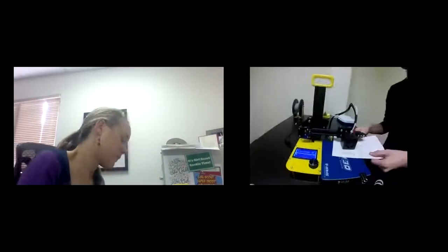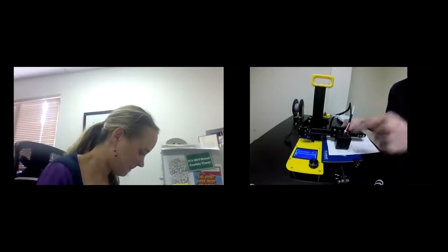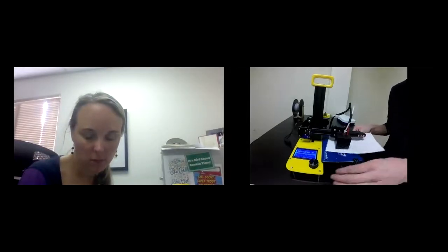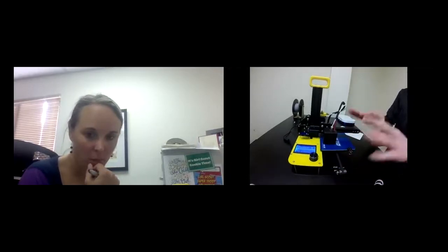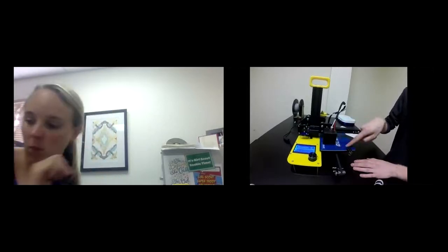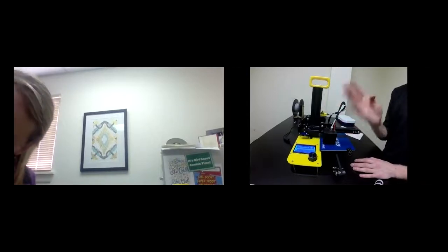Once you have every point checked, I like to check the middle too — once every point feels okay, check the middle to make sure it feels right. So now we're going to talk a little bit about filament and how to load it in and prepare it for printing. We got this area level so the plastic will lay down onto the surface.